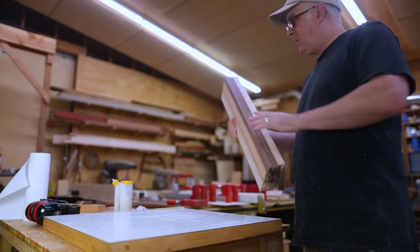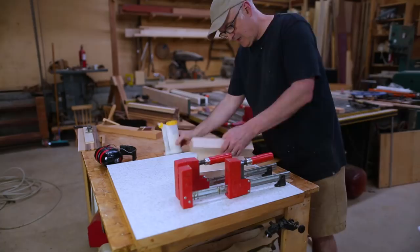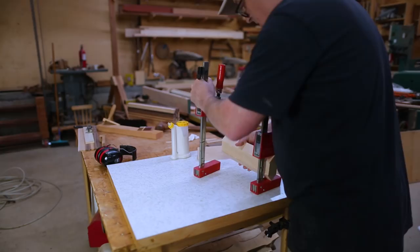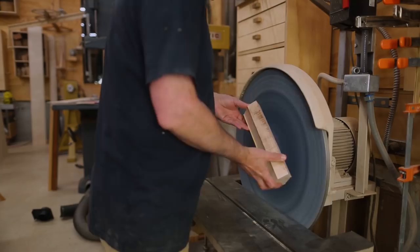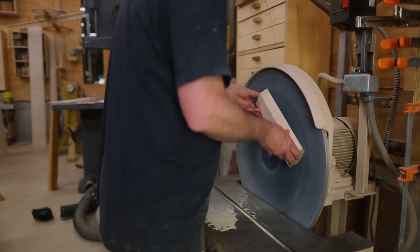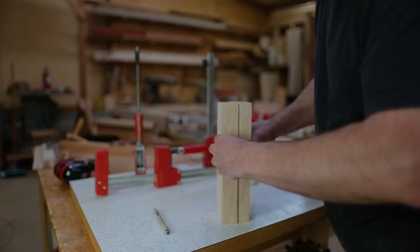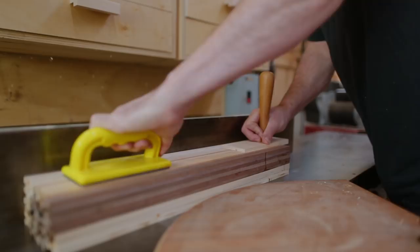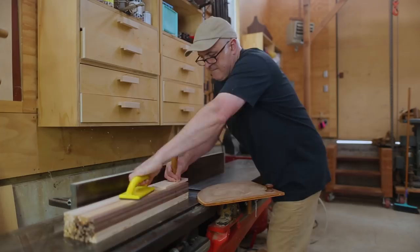Now I can glue those pieces up. I glued the triangles on the opposite sides first because I could clamp that fairly easily and get those two glue joints really tight. Then once that's set, I can sand off the little bit of extra triangle that's on each side — so I didn't have to worry about making those triangles perfectly the right size. Then I can glue on the triangles on the other two sides, forming a square. You can see the square and the pattern that it makes. Now I can clean up the patterned piece and joint the sides of that, also making it square.